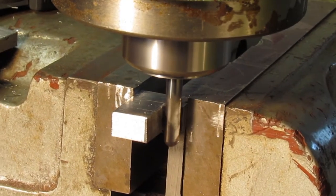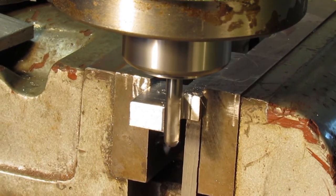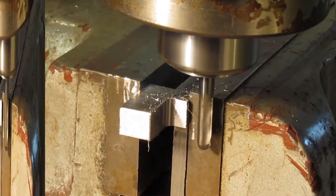Having removed the excess material, I now set up the part in the milling machine, using a 1/4 inch carbide end mill and milling only with the flutes. The only reason for using this end mill is due to the financial burden COVID-19 has placed on so many households, so tooling will have to wait.